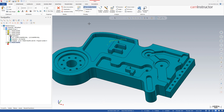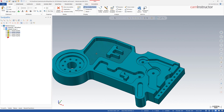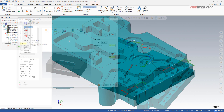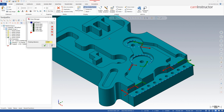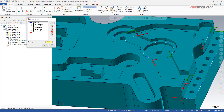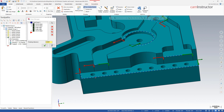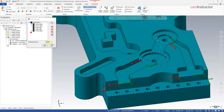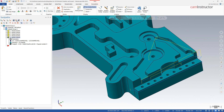There is one more situation I want to cover. I'm going to copy this model avoidance chamfer and add some extra geometry to it. I've added some chains into this operation — it's going to have to avoid the solid model and make sure it doesn't gouge. I've still got the original geometry, I've got this section, this edge, this edge, and a chain that runs around here. All of these chains have possible collisions at the beginning and end of the path, so I'm going to launch into a solid verify and have a look at the results.